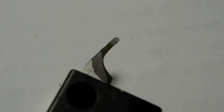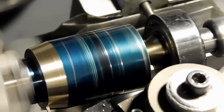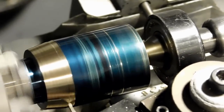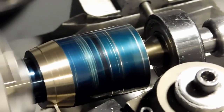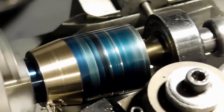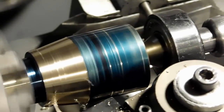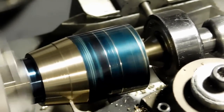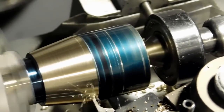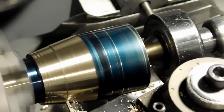This is a trepanning bit that I made some time ago. You can see the top has been modified — the top rake is zero for brass, but I often make it six to five degrees for brass, aluminum, or steel. These cuts I'm just removing brass; I don't care about the finish so much, just going back and forth. You can see on the left side there is that shoulder, and now moving up to the right to the line that I have to get to.